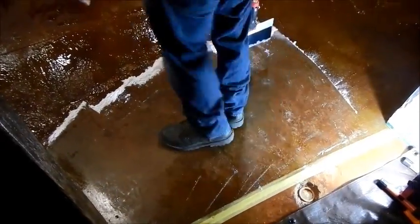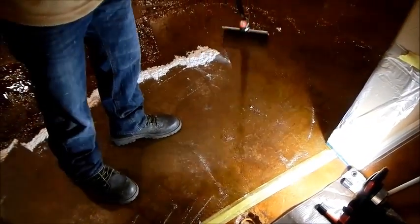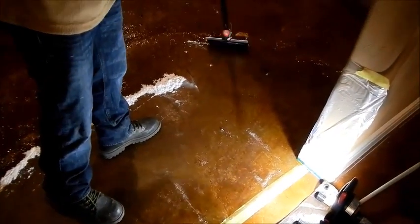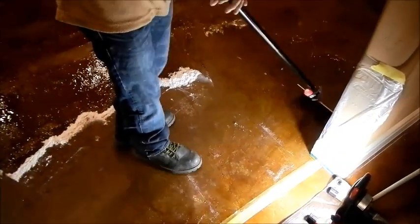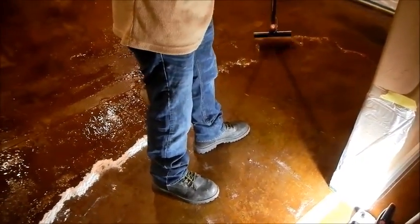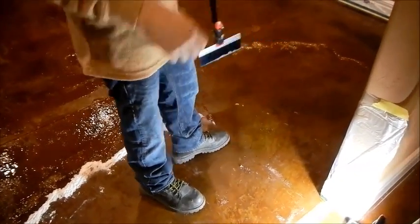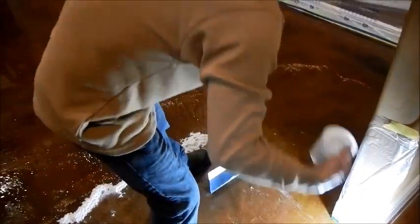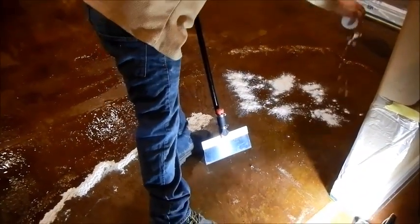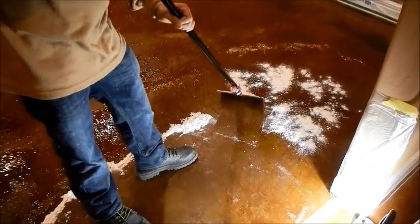As you can see, it just moves the material forward. The absorbent has a couple of purposes: one, to reduce the slipperiness of the floor, and second, to help you collect the liquidy sealer that you will create after it has melted from the application of the Seal Green SCR1600. We just spread the absorbent wherever we're going to be walking ahead of time and push it forward to allow it to start collecting the material in front of it.